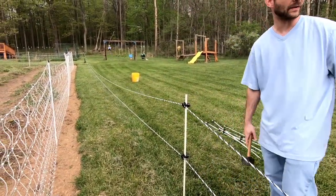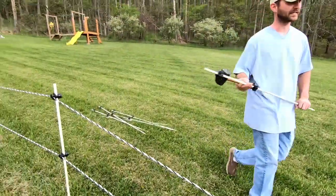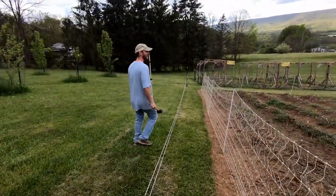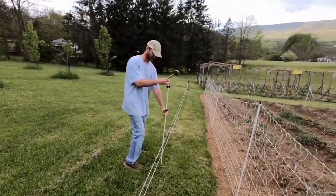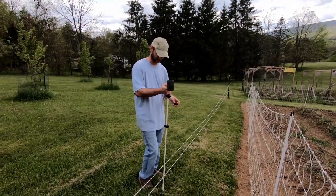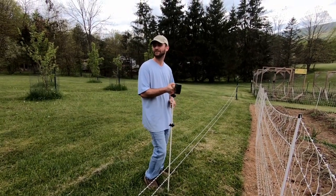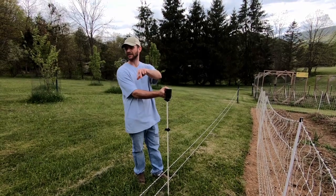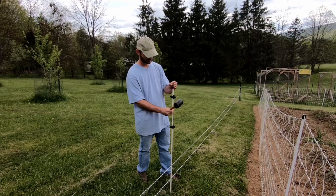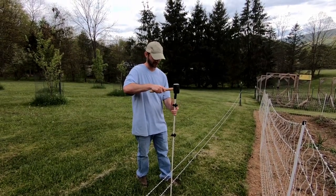So now I've got the middle — you'll see these are slacked, so I just split it in half. Do one side then the other. I think you're not supposed to have these any farther than 33 feet apart, so seeing as how we have 100 feet long, I have four sections so they're approximately 25 feet apart — or 25 feet of unbraced length, so to say.